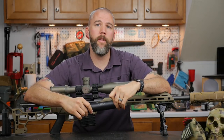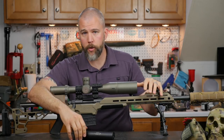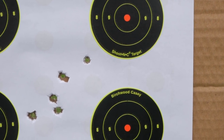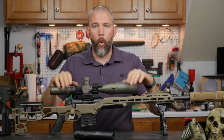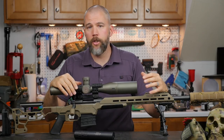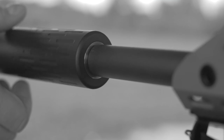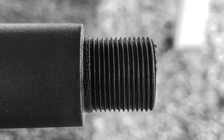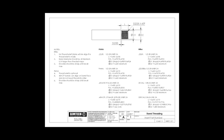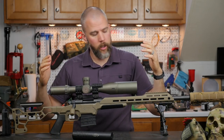That's where we started to see our first problem with the Tracker — though we figured out it was actually a problem with the way the Tracker worked with the host rifle. We saw a really nasty stringing group, not the tight group or expected shift we'd normally see. On closer inspection, we found an inconsistency between the threading on our Remington 700 factory barrel and the specifications Gemtech publishes on their website. This was not allowing the Tracker to thread down and seat consistently, so we stopped shooting it on the AAC-SD.